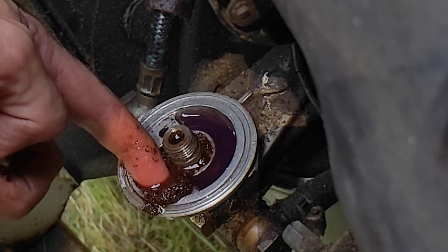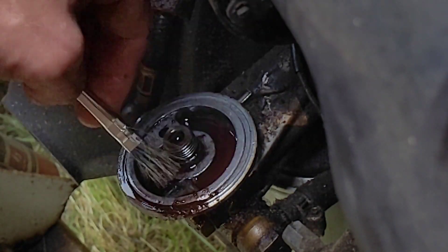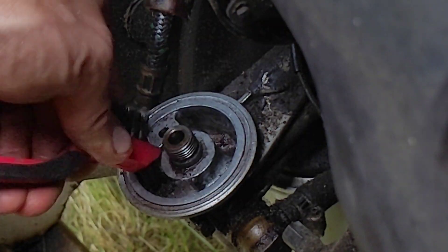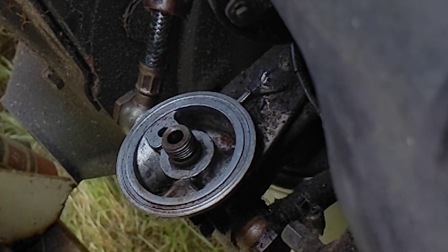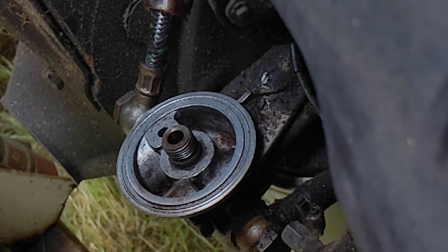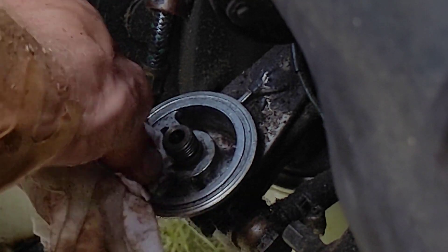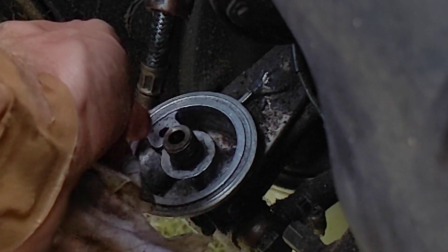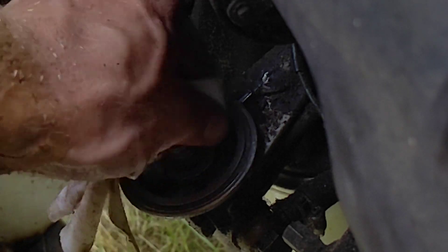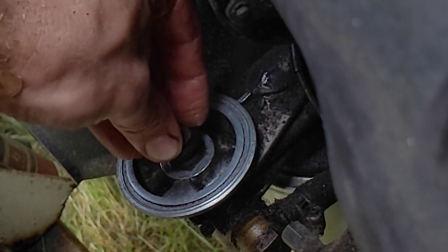I was just thinking I might as well change the fuel filter since I ran out of fuel, but maybe I had a little bit more going on here. Let's get this all cleaned up. If I was up at the garage, I'd get Q-tips and work a lot more of that out, but I'm not, and I still got a couple of acres of hay to put up before I lose the light. So I'm just going to wrap up this clean — got a good 90-plus percent of it. I hate leaving a little bit in there, but I'm a bit of a perfectionist with this stuff. Put a little bit of clean diesel in there.